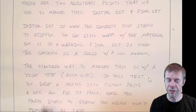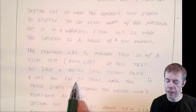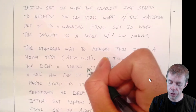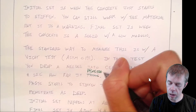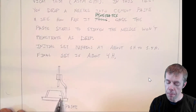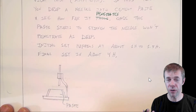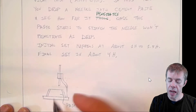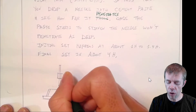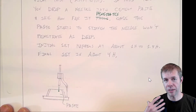The standard way to measure this is with a test called the VICAT test, ASTM C-191. In this test, you basically drop a needle into cement paste and you see how far it penetrates. It's kind of like you're driving a pile into cement paste. You have this big pool of cement paste, needles of different sizes because they'll cause different stresses, and you drop them from a known height with a known weight and measure how far it goes in. You can measure it getting stiffer and stiffer over time.